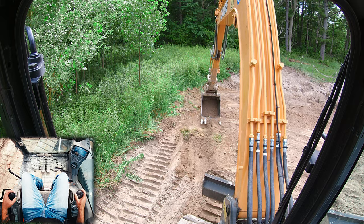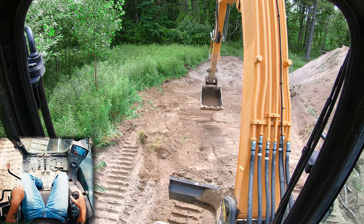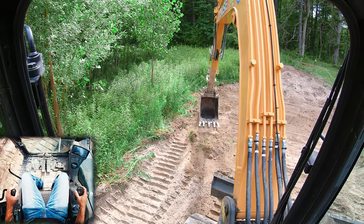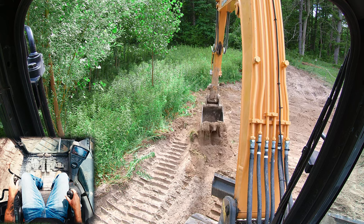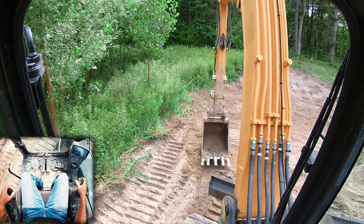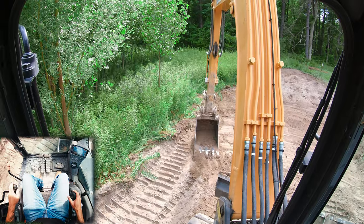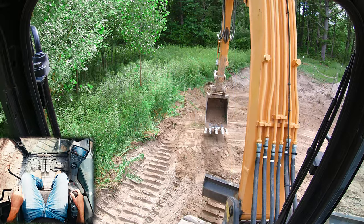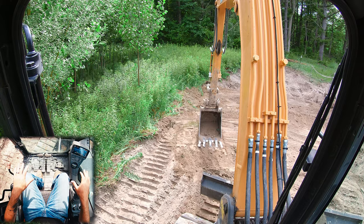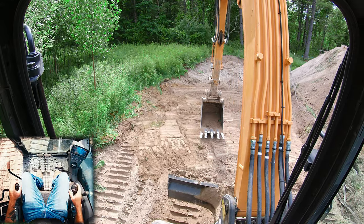Right about here we're getting to the point where it's going to be hand work sometimes — you just can't get out of it. If we're talking basement grade or stone grade, right about here is where I'd be okay doing just a tiny dig into my grade — only about an inch or so. I take that material and shuffle it over to fill that little hole, then give it a couple smacks. This machine weighs eight tons, so with that smack I've got the majority of the machine's weight popping on it — you've easily got 95% compaction. Look at how flat we are.